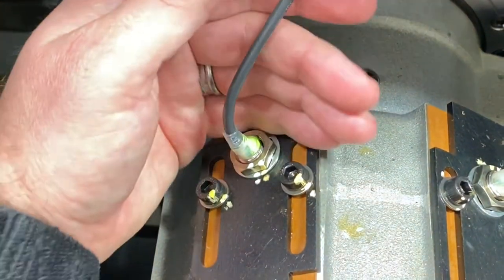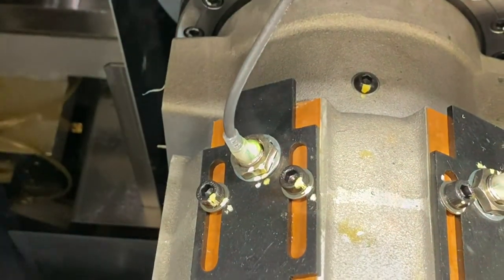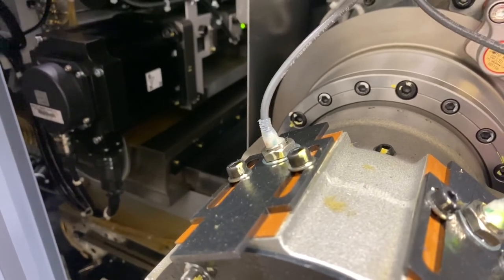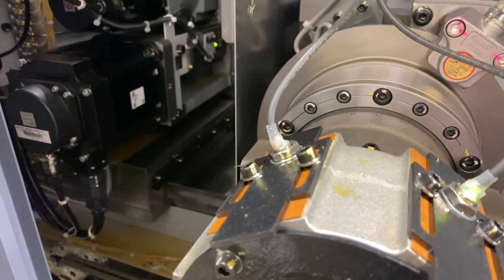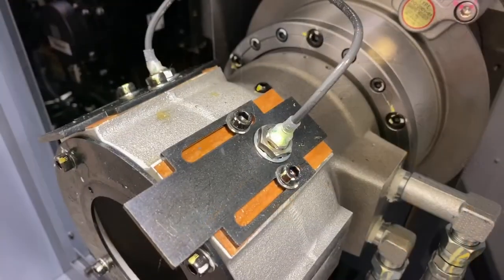You can visually check the status of these sensors. There is an LED on the sensor indicating three states: off, green, and red. The forward proximity sensor, or push sensor, will sometimes be out of adjustment with the forward end stroke of the draw tube. When this sensor is completely out of adjustment, the LED remains off. The draw tube and collet sleeve move forward but the sensor does not detect the ring. This will trigger a chuck adjust alarm.